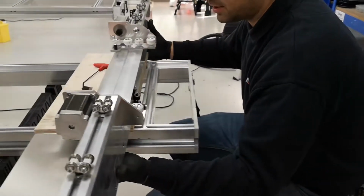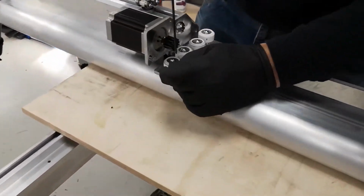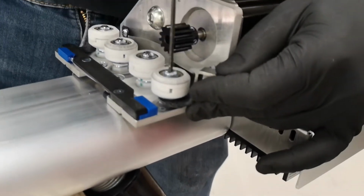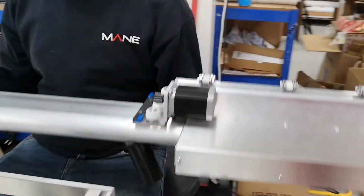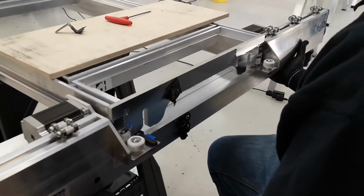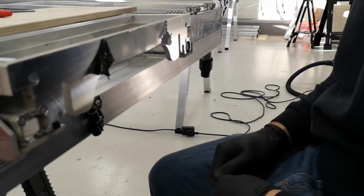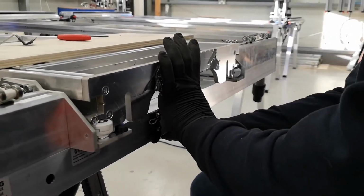And we just fully lock the first set of wheels as well in this position. Just a case of holding, lock, hold down, lock, and we just check our preload again. Yeah, that goes in nicely. Check again our squareness. Yeah, it has not changed, because it might change if you move the cam.